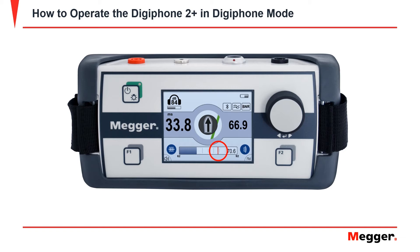The red line represents the strongest signal received. The numbers on the left appear when the sensor is close enough to the fault to pick up the audio signal from the fault. This number represents the time difference between the electromagnetic pulse and the audio signal. Units of measurement available include milliseconds, meters, or feet. The number on the right represents the time or distance difference from the last position.